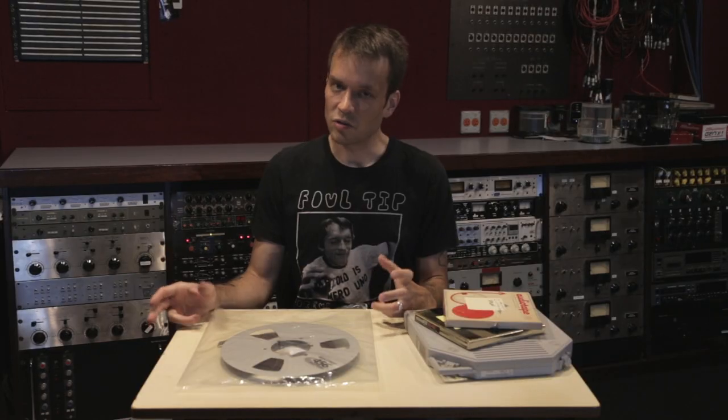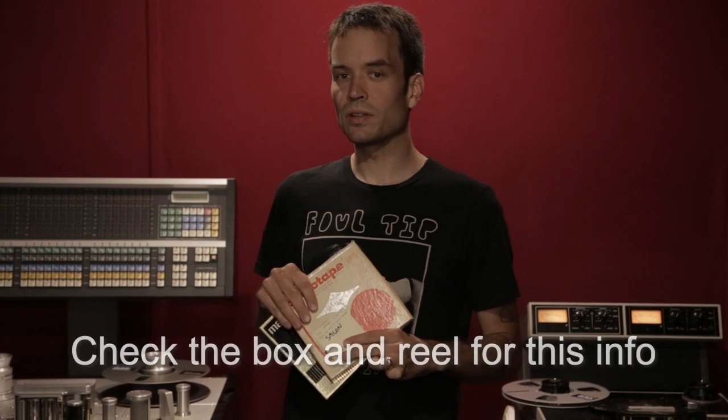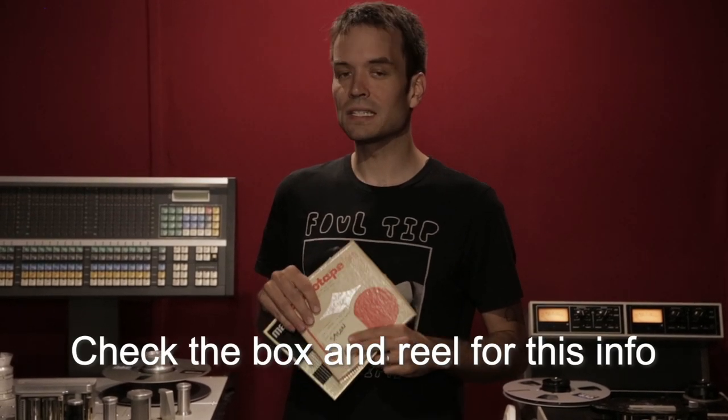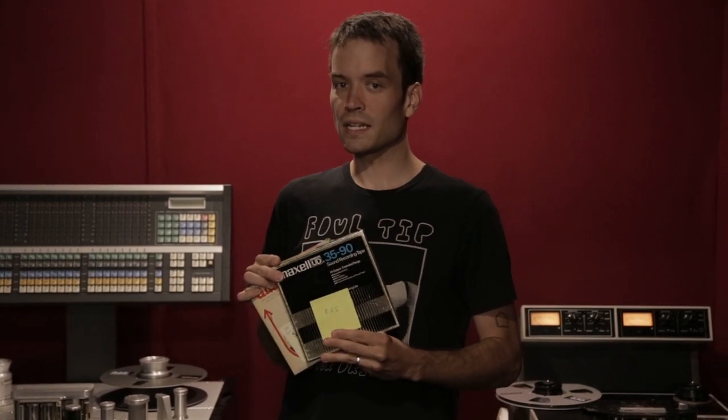The remedy for this is that you bake a tape at a low temperature for a long period of time. Before you put your tapes in the oven, it's good to establish whether they need to be baked. First and foremost, check the composition of your tape. If it's a cellulose acetate base film, it does not need to be baked — and actually it's flammable, so don't bake those tapes. If your tape is a polyester PET base film tape, you can do a series of playback and wind tests to determine whether it needs to be baked.